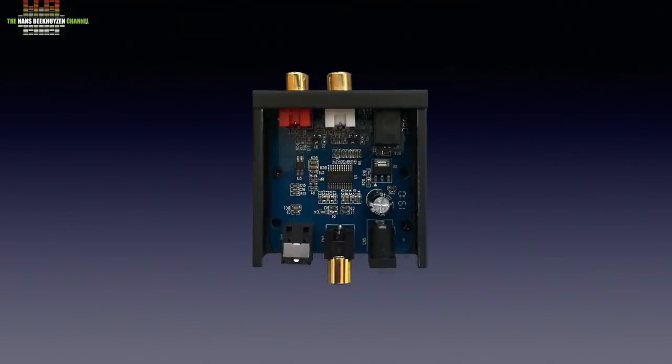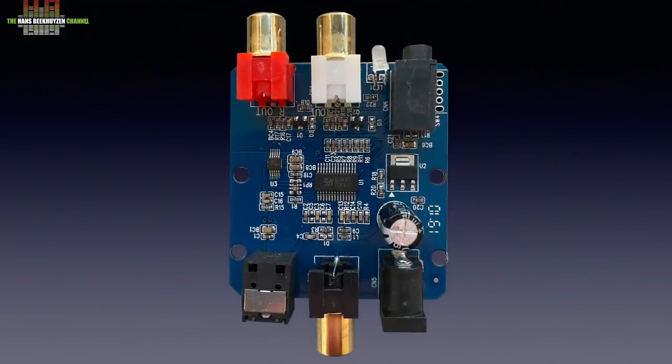Inside we find a small circuit board — let's take a closer look. The incoming 5 volts DC is regulated down to 3.3 volts, so the internal circuit after this voltage regulator runs on 3.3 volts. Next to it, the Rui Meng MS8416T digital interface receiver translates the incoming AES-3 signals from either RCA or Toslink to the I2S signal that is sent to the upsampling Cirrus Logic CS4344 DAC chip. So far so good.